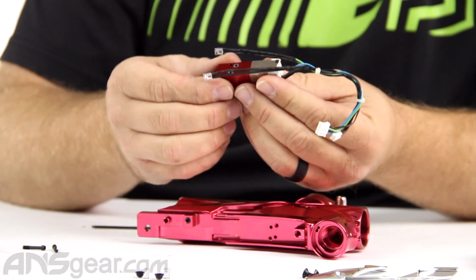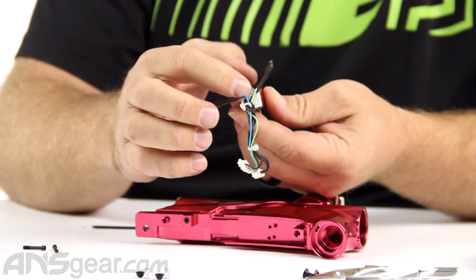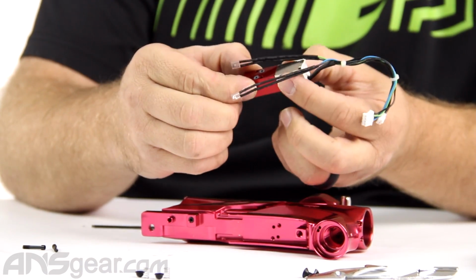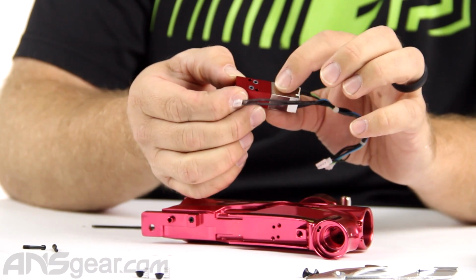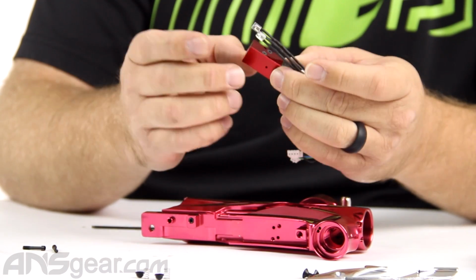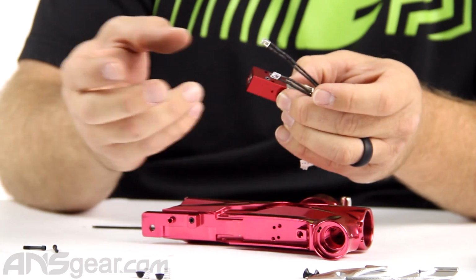Now you can do solenoid maintenance, only one side of it though. They've got this side covered right here. There's two screws on here that will let you take the silver part off the red part. You don't need to do that. There's nothing on this side that is serviceable by you. You can pull the spool out of the solenoid and clean it.